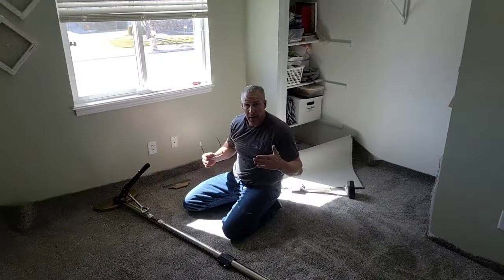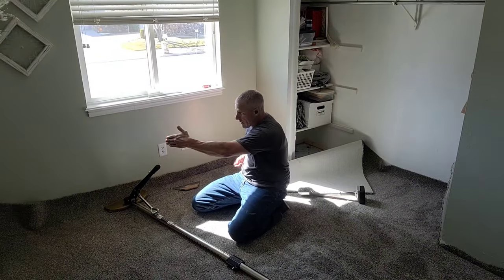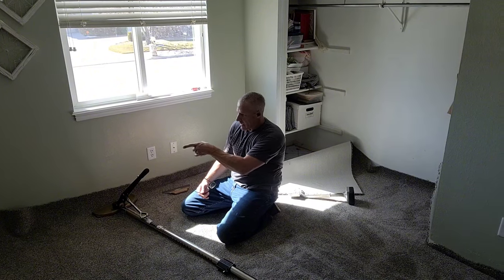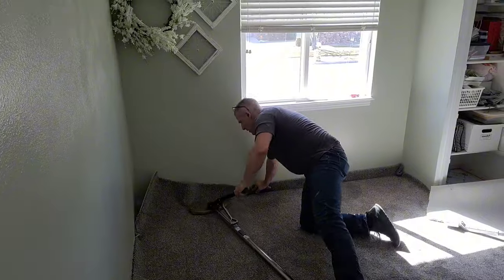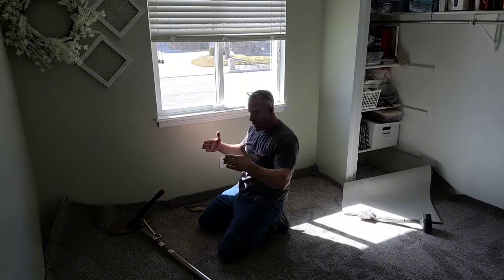I'm going to stretch everything into this corner over here. I'm stretched out of that doorway, and now I'm pulling everything, and then I'll set the closet. I like to stretch out of the closets, so we'll stretch everything, and we'll end up in that corner over there. That's how I've got the stretcher at an angle, too. We're just going to angle everything into that corner.